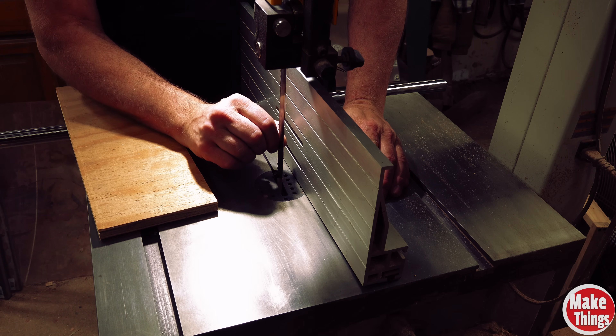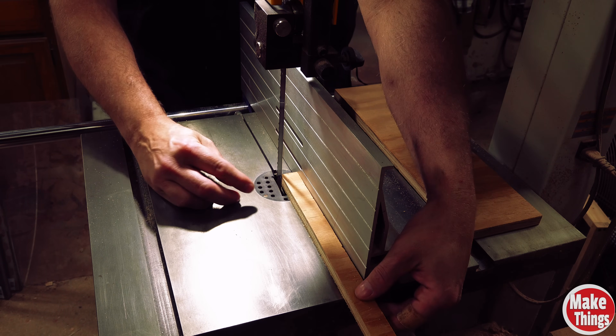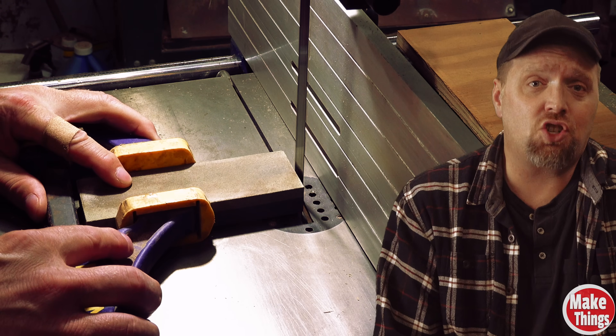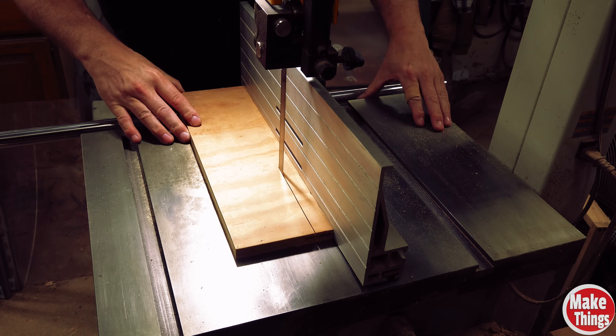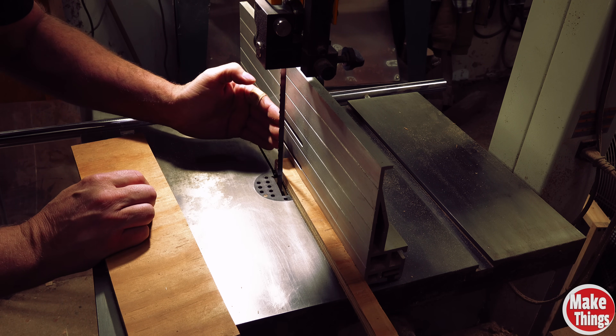Blade drift occurs due to one side being sharper than the other side. That's why blades that are brand new are more likely to cut parallel to the tabletop edge. But let's test this. I've got my fence exactly 10 inches from the edge. This is a very old blade, so I'm going to check to see which side it drifts to. You can see that the blade has drifted this way, which would make these teeth sharper than the other side. To test whether or not this dulling of one side creates this mystical drift, I'll use a sharpening stone and move it onto the right edge of the blade. Now flipping to the other side — this is the side I cut last time — we're going to see if the blade will shift. And as you can see, it got much wider. That means I've dulled this side enough that it actually pulls the other direction. Just as what was written in the 1949 Popular Mechanics, we can see that having an unbalanced blade in terms of sharpness is the real problem when it comes to drift.